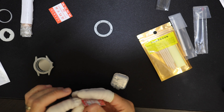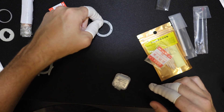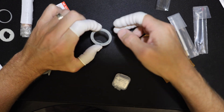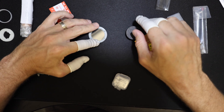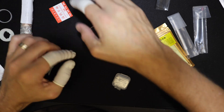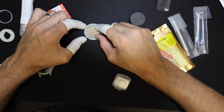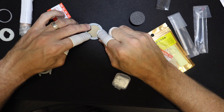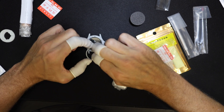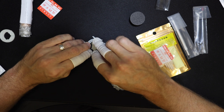I've never seen an exhibition case back on a quartz watch, but this is my watch so I get to do what I want. We're going to put an exhibition case back on this, which requires a second piece of glass. You don't have to do this — they do have a solid back as well. The crystal in the case back is held in with a little band, a 3D printed part — the same part used to hold the crystal in the case itself — and there are two versions depending on whether you need a holder or a holder with a chapter ring.